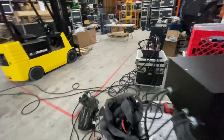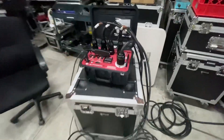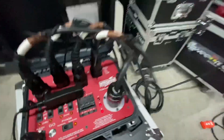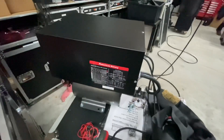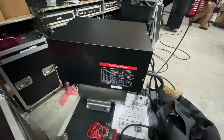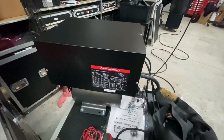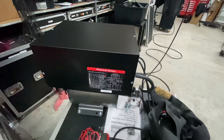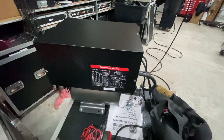You can see over here on our controller it's just showing Y and Z. When we turn this on it's going to generate that other leg. Before I turn it on, just to explain it: we're going in with single-phase 220-volt power, or 240 depending on what your voltage runs, and then it comes out — if you measure from leg to leg it's 208, 208, and your other leg is going to be just a little bit different but very close to 208.